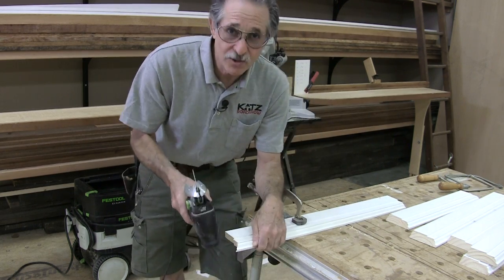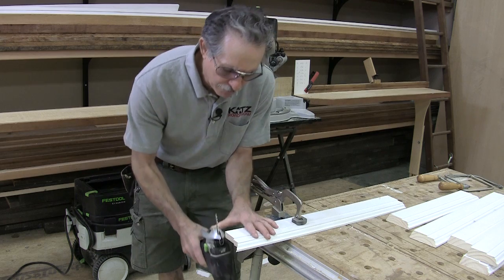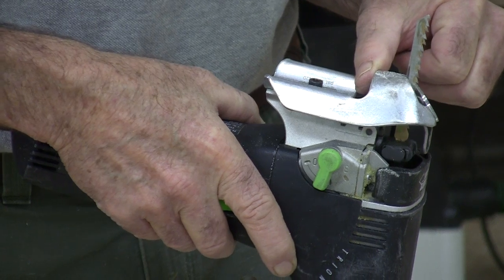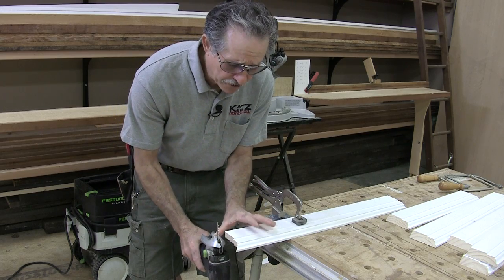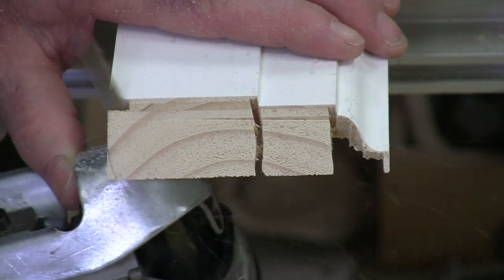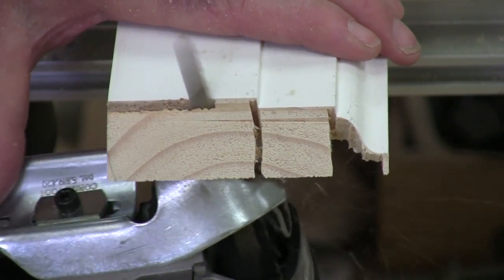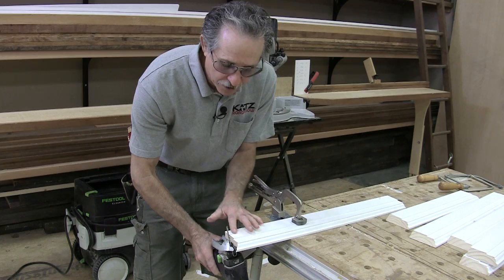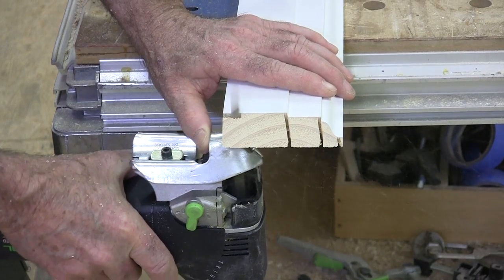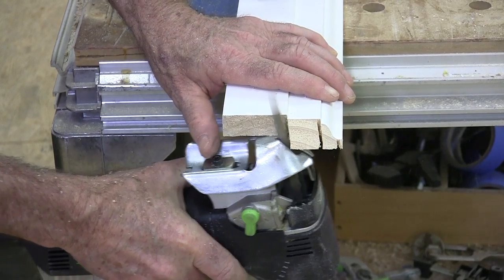So when I'm using this one, I use it in two positions. This is the push position, where I'm pushing the blade into the material away from me. I have my thumb behind the guard on the coping foot. I have my fingers on top of the molding, and when I make my cut into the molding, I tip the motor down and then I rock the tool up, just like you would a Sawzall or something, but with a lot more precision. And as I'm going into the fillet here, which is usually fairly high, so you have to get in pretty deep, I slide my thumb back across the top of the guard so that my thumb continues to stay in contact with the tool.